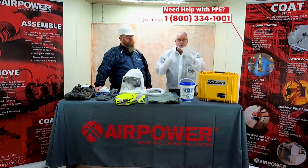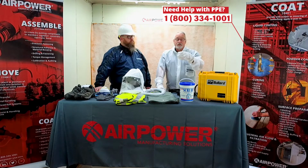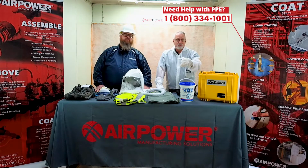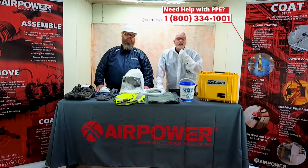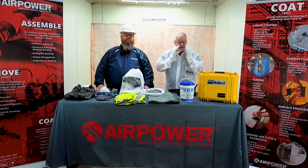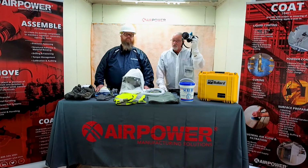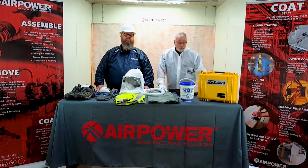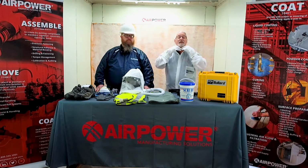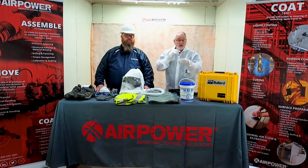And a lot of your OSHA and your in-house people that you have there at your shop are going to require a fit test. They take the ammonia thing like they used to do for boxers. They break it open and you smell it and see if you can smell any of that ammonia, because this takes that out. You don't smell any of that with this. So if that doesn't fit well because of facial hair, then you can go to a couple of other things to help with that. There are the fuller masks that go around you that have a little bit more coverage for somebody like a goatee that's trimmed up.